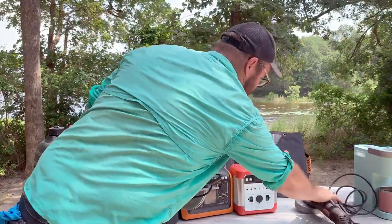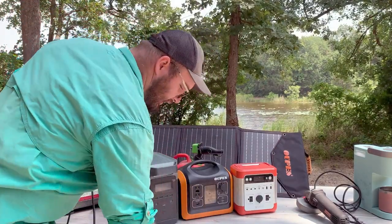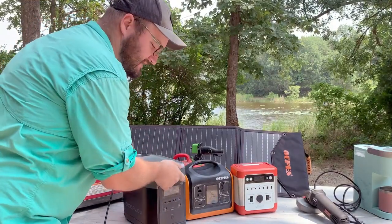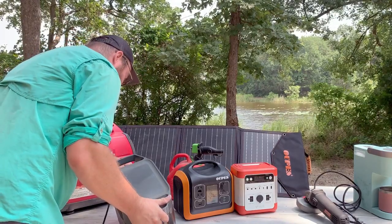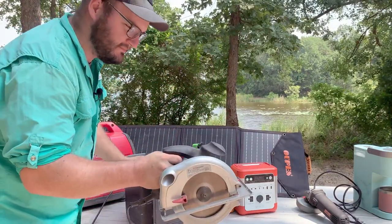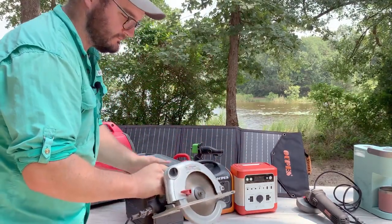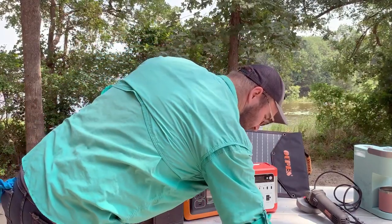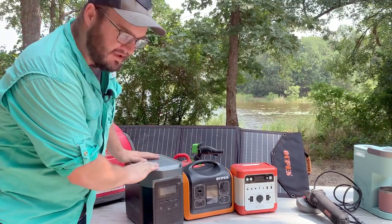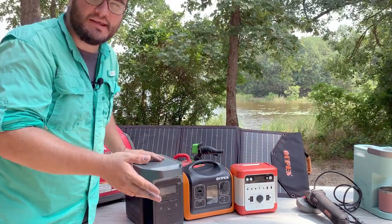For fun, let's grab this skill saw and plug it in. This isn't something you'd use for heavy work because at 560 watts you can probably only do that for a little while. The skill saw was drawing in the 650 to 700-watt range, so you're not going to be able to run it too long — maybe half an hour of cutting or something like that.